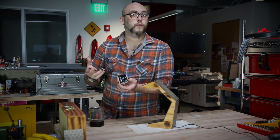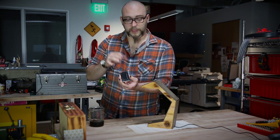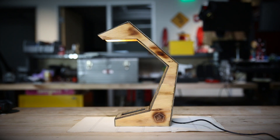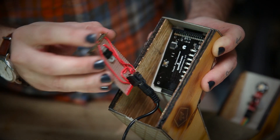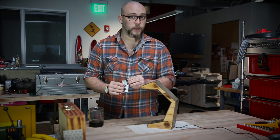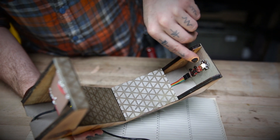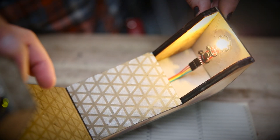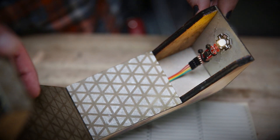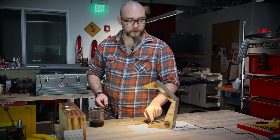You could hook this up to an Arduino, an mbed, an Edison, or anything like that, and you would be able to send the position of the TouchPot to that microcontroller without having to read it like a potentiometer using an ADC. To show how this thing works, I've put together a demo — a dimmable desk lamp. It's just one of these TouchPot boards with power coming in. I've taken a 9-volt wall wart and I'm regulating it down to 5 volts to supply the logic for this board using a voltage regulator. Then I'm taking the 9 volts from the wall wart and feeding it up to one of our FemtoBuck LED controllers, and I have a 3-watt warm white LED connected to the FemtoBuck. I'm controlling the brightness of the FemtoBuck by running the PWM signal out of the TouchPot into the FemtoBuck, so as I move my finger up and down the TouchPot, the LED gets brighter and dimmer. To turn it off, I just go all the way up to the top.